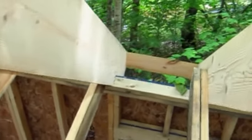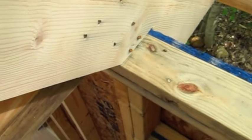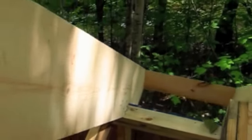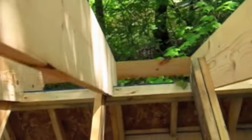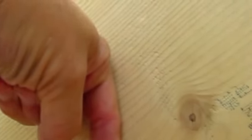But if you didn't have — and you can see those toenails right there — you can see those two little nails down there in the center of the frame. But that's not enough to hold those rafters in place once you put all the weight of the shingles on there and the snow. What wants to happen is the weight is bearing down on the rafter, and it wants to make the rafter go down, which would kick out the wall.